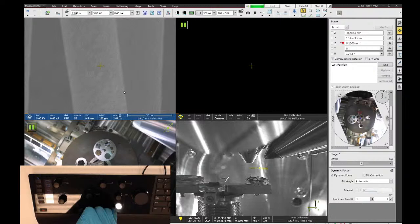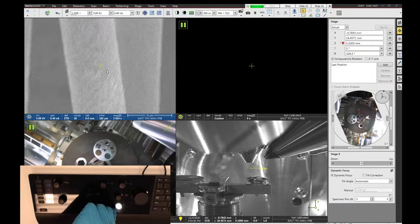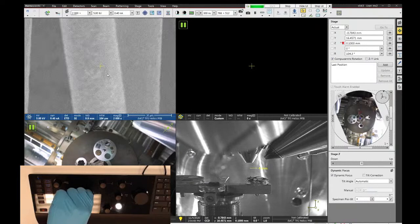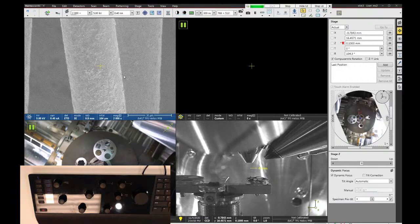Now, I have a lot of astigmatism in this image. If you can see that, as I go back and forth through focus, there's a lot of diagonal stretching or diagonal smearing going on here. I'm going to fix some of that because this is really obnoxious to me. I think I'm pretty close to focus, and then I'm going to change my stigmator X and stigmator Y and get that a little better. All right, not bad. So 9.8 millimeters is the distance between the lens and the sample,